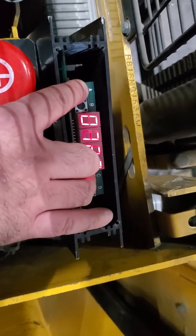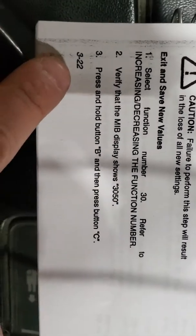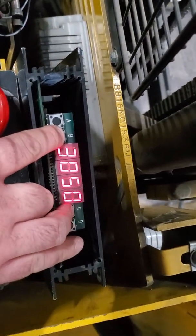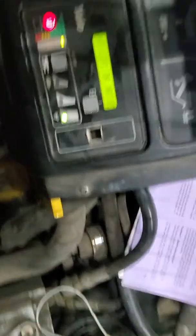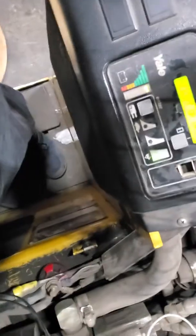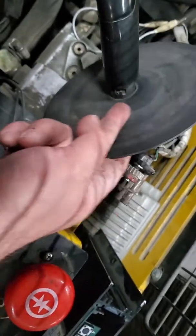Use A and D to scroll down to function 30, which should show 3050. Press and hold B, then press and hold C — this exits calibration mode. The truck will power on. If calibration was done correctly it will say 'step on the pedal and accelerate' and all functions should be available. If a potentiometer didn't get a reading, the calibration will show as failed.